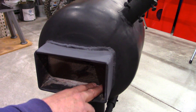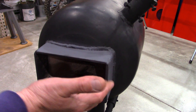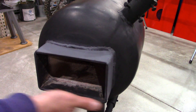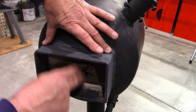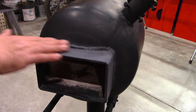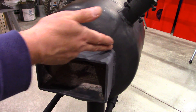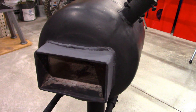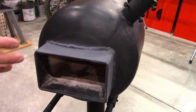After cutting the 7-inch by 4-inch openings on the front and rear, I took a piece of quarter-inch flat bar — quarter-inch by 3-inch, but it doesn't stick out 3 inches; that's just what I had on hand. I made this opening so it's sitting flush with the existing opening — still 7 inches by 4 inches. I used the cutting wheel to cut the angles so it sits flush on the tank. Basically I took the piece of flat bar, put it in, scribed it, and cut it with the cut-off tool. So I welded up a little box around the front and rear. Now I have a nice, clean opening that actually extends the tank a little bit in the front and rear.